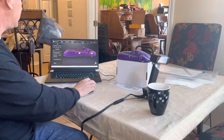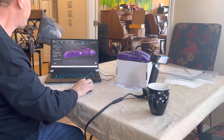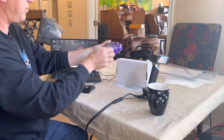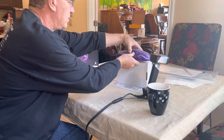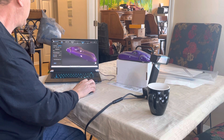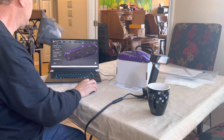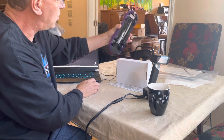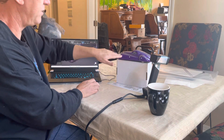Here's what I ended up with. All of these shiny spots are those markers — you can see them right there, repeated right there. When you turn to the front view, it looks like it has two headlights that are out of place, but those are actually two markers I purposely placed asymmetrically so they wouldn't interfere if I need to mirror image something. I now have a 3D scan and by using the texture mode I got the color. I had to go in and cut away all the extraneous material. It is hollow because I didn't scan the bottom side, but there's nothing under there we'd need to duplicate since we're going with the Hellcat drivetrain.